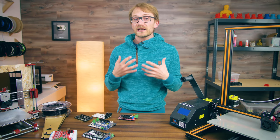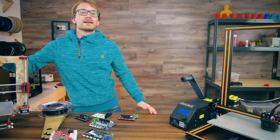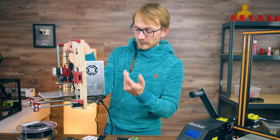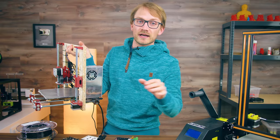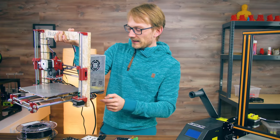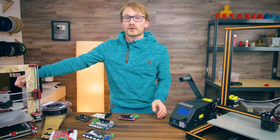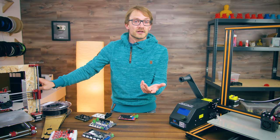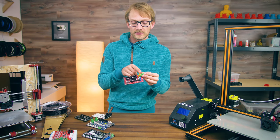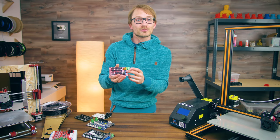The other thing to look for are fuses. Admittedly, I'm not paying as much attention to them as I should be, but they are kind of important. Your power supply can typically supply around 25 or 30 amps, so it can output that maximum amount of current before it shuts off for safety. So if you short out the output right there on the supply, it will just shut down, nothing's going to happen. But imagine you get a short right at the heater cartridge — the only resistance at the output is the MOSFET and the wires, and that often means there's now enough current flowing through wiring that obviously isn't made for those currents, but still not enough to trip the power supply's over-current protection. So what you need is individual fuses at every single output ideally, not just at the input. The power supply already has self-protection built in, but it is way too lenient to protect each individual lower-power output.